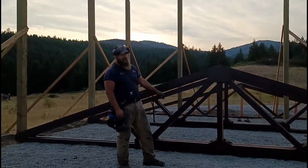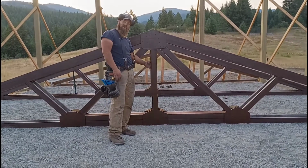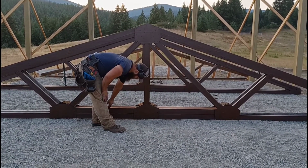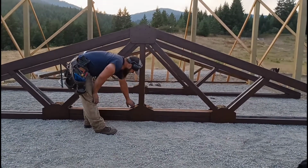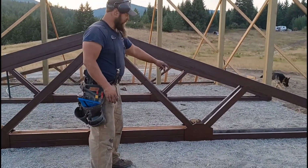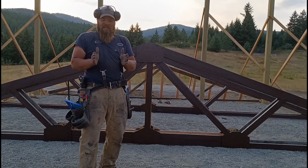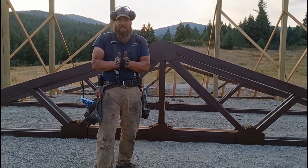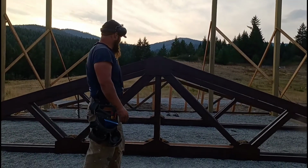So over here are our freshly painted trusses. I've reinforced them. I put a center web support in here. Added a bottom chord support right along the bottom because there was a joint in this board that I didn't like where it was. So I added this. And then these are plywood gussets that I've cut out and placed on here in those 3 points. Now, these still need squisher blocks, so these trusses will sandwich together with a squisher block in there, and it'll become one piece and be raised up the post. I'll show you how we do that later.